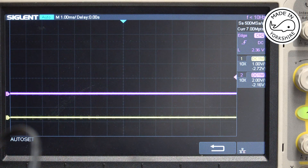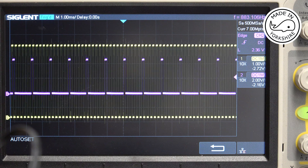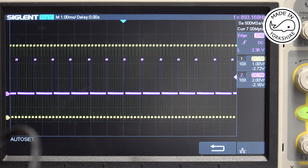I just thought I'd show you the pulses on the scope. This is based on a rotary encoder with 600 pulses per revolution and the stepper motor at 2400 pulses per revolution. So for a 21-tooth gear, I'm looking for one pulse going out for every five and a quarter pulses coming in. That looks pretty good.